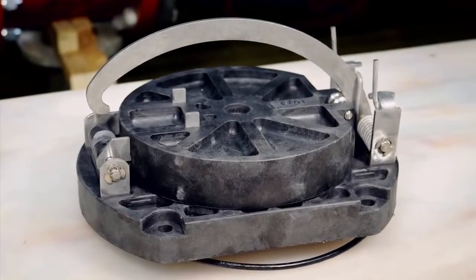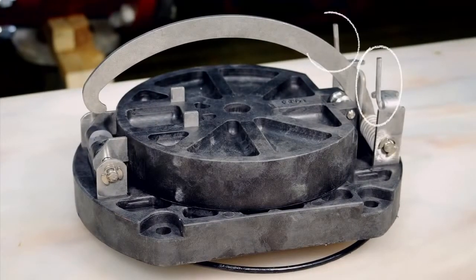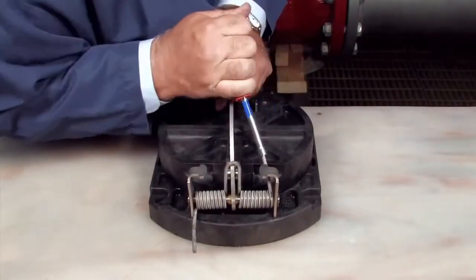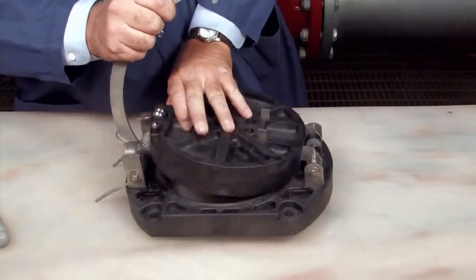To open the number 2 check, you'll first need to release the tension holding the clapper shut. Locate the two cam arm torsion springs. With a 3/8 inch nut driver placed over the torsion spring, move the spring away and around the retaining bracket to release the tension. Do the same with the second spring and the cam arm will open with no tension.